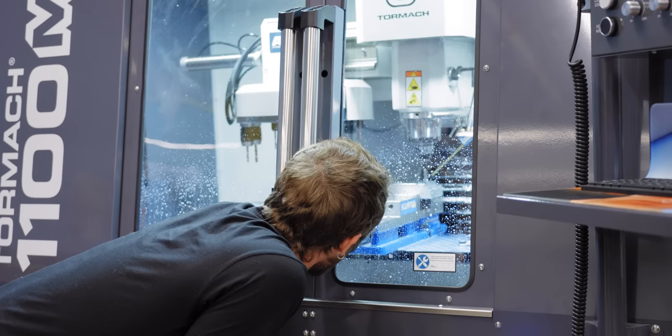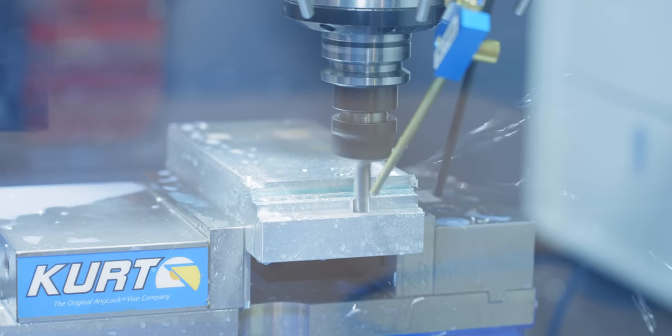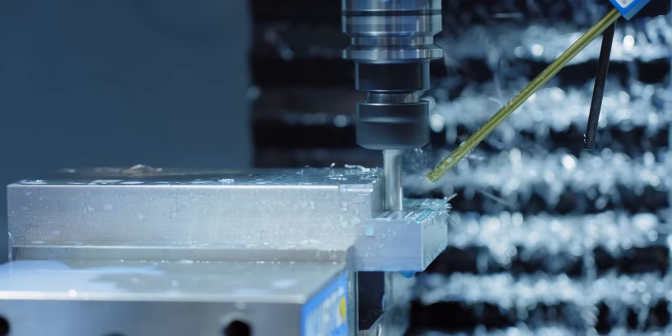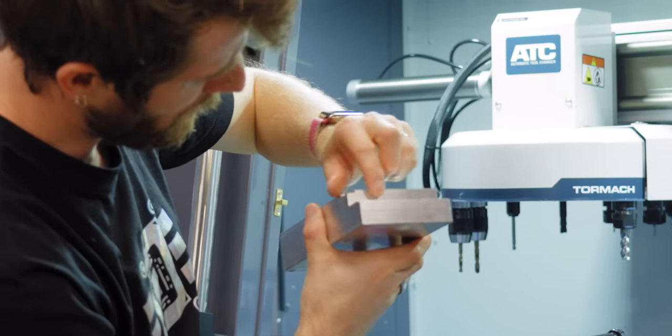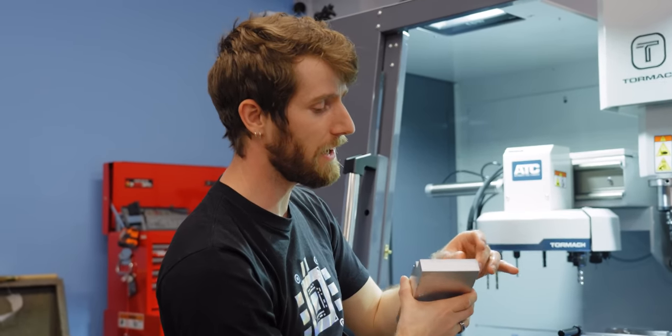Oh wow, that's pretty wimpy, isn't it? It's called minimum quantity lubrication. So it's just enough coolant to keep things moving. If you need something to be, say, clean, you can run clean fluids rather than a recirculating coolant. You can have a different one in your mister versus what you have in your flood coolant. It can get fancy. Oh my God, like somehow it's both perfect and not sharp.